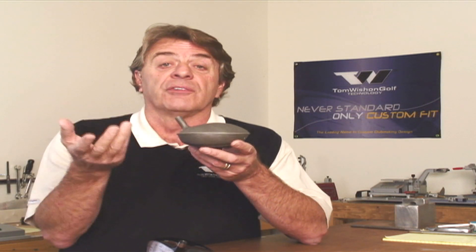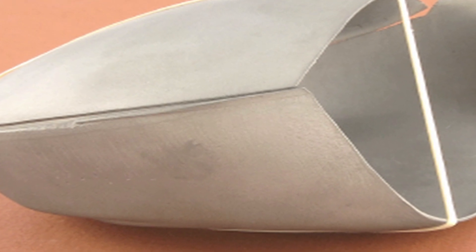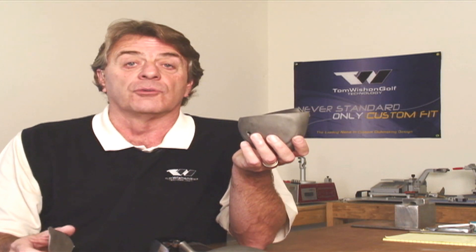Let me contrast that with the way that the vast majority of other driver heads are made today. Other driver heads are created in what we call an edge weld situation. As you see, I have a top crown here, and then I have the sole skirt. When these parts are put together to be welded, there can be small gaps around the edges of the parts, and more welding has to be added to hold those pieces together. To contrast what is a normal edge welded face — that the vast majority of other drivers employ — versus our cup face design, here's one of the face plates of a traditional driver. These have to be put together so that you have welding on the edges. Welding lines are much more inconsistent, compared to our cup face design where the precision of the mating of the parts allows that welding to be far more consistent.